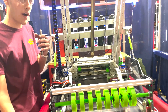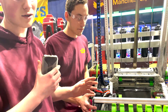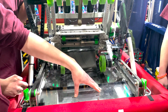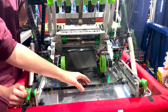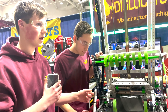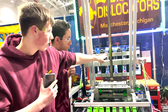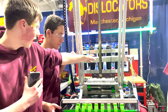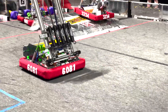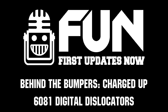I'm going to pass it off to Curtis now to talk about vision and some of our future plans. Currently we do not have any vision systems on this robot due to weight issues. But when we do, we're going to mount a Limelight under this piece of plexi here that will handle AprilTag and reflective tape detection. We're going to implement a sort of auto-aim feature where it centers the robot on the scoring position, making it even more automated to go with the presets. Our other vision system will be a fisheye camera mounted up here on the air tank rack, able to see basically everything in front of and inside our robot. Thank you so much for watching. Thank you to 6081 for taking the time to talk to us today. They're doing a great job at Kelvin University and we can't wait to see how they do the rest of the season. Thank you for watching Behind the Bumpers and have a great rest of your day.